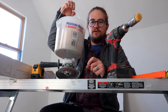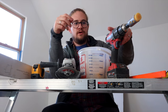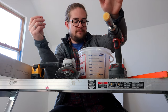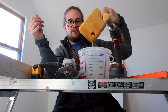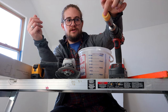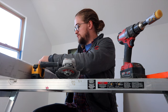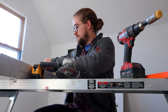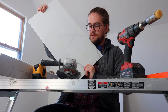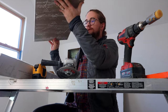I always like to have a bucket with a sponge. And here's a trick I used for my hole saw: because you want to cut tile wet, I just cut a hole out of my sponge with the hole saw. Now I've got my sponge in there — you just soak it and drill away. Most importantly, you need your actual tile. I'm using a 12 by 24, what they call large format, because it is large.